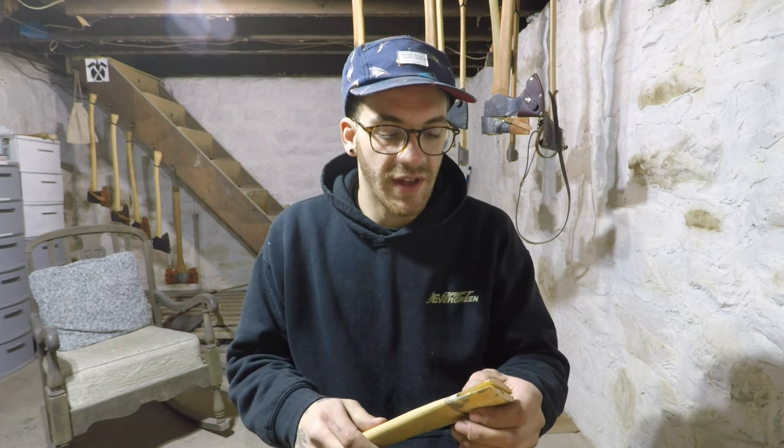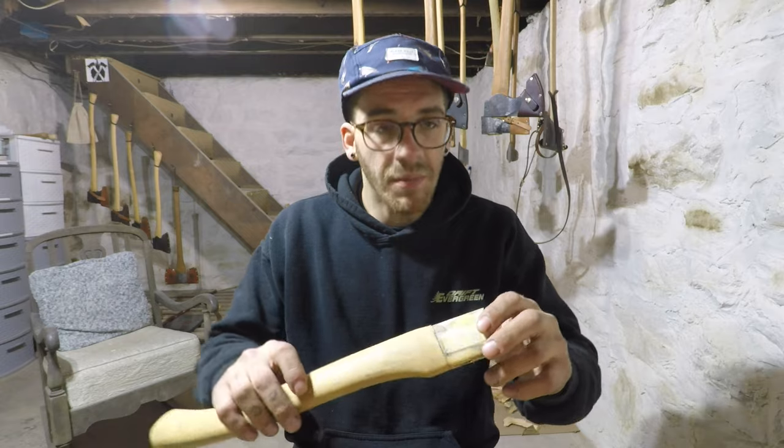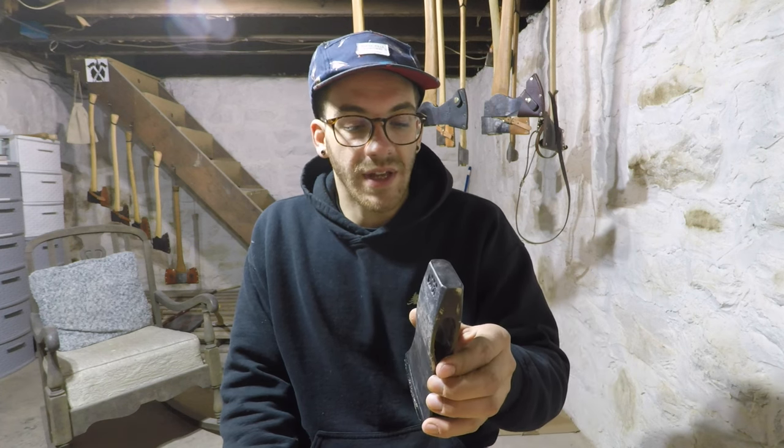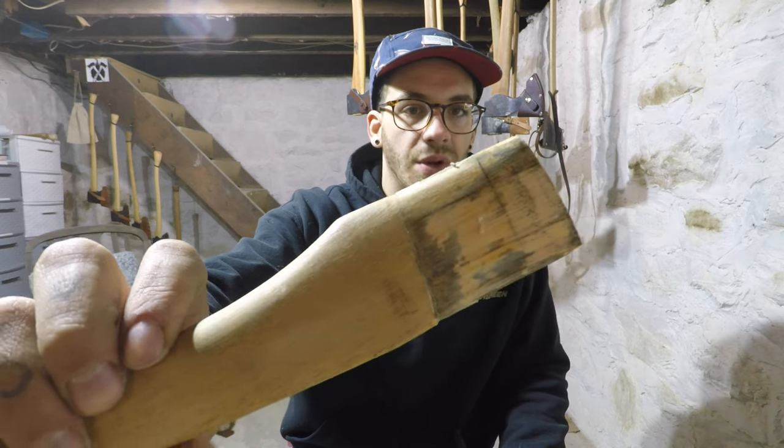Now that we have the head off the handle, this isn't a necessary step but I like to figure out why it failed — what was the fail point. I like to see how the company fit the handle to the axe head. From what I can see it was hung pretty good, but because they're hydraulically seated there is a little bit of shelf there, which I assume was the issue. Also, for Council Tool Flying Fox lovers — it has eye ridges, kind of like what Kelly or True Temper would have done back in the day. You can see the impressions in the eye wood. You don't see too many newer axe heads doing that, so I thought that was pretty cool.